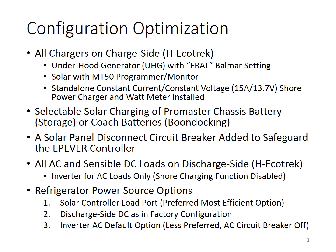There are a lot of advantages to doing that. First of all, we utilize the solar charging as often and efficiently as possible. By connecting it to the solar port, we can also continuously monitor the power usage by the refrigerator. The other two options are still enabled, so we could switch it back for the refrigerator to charge from the factory configuration, including the discharge side and the inverter AC.